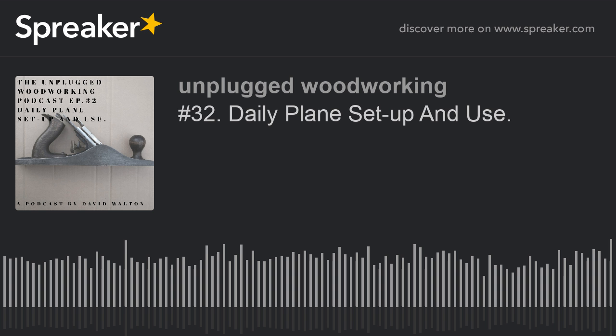So make sure it's sharp. And what I've just been mentioning as well, make sure the sole is oiled, and do this often. I have no idea how many times I do this, but I do it a lot. I also do it a lot with my saws, and I even use it on my chisels as well. Notably more on my plane, I would say.